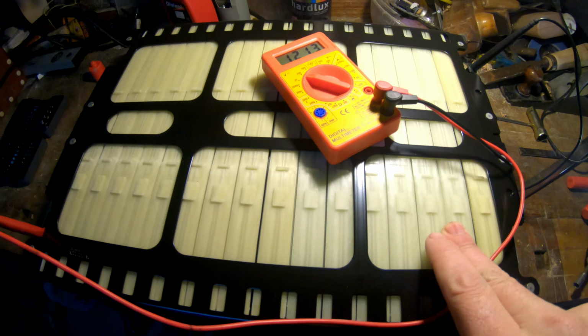Here you can see the charging port, another one is here, and these are the discharge wires. I put them here, this switch, so I can put them on and off. This is another switch, I can disconnect if one of the batteries is charged more, because I don't have a BMS that will control each cell to be charged to the same voltage. I ordered one, and then I will connect it to these small pins you have seen here.